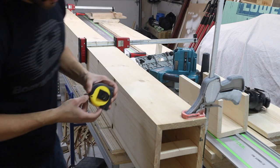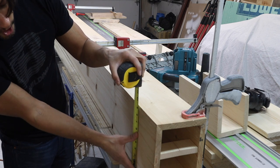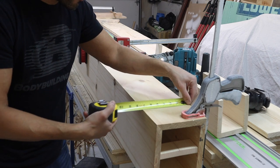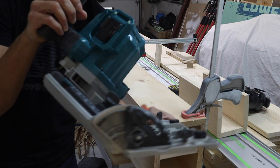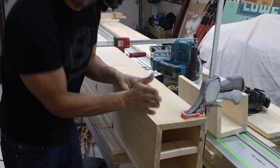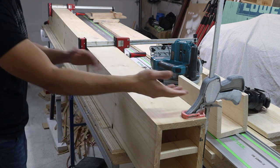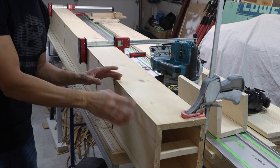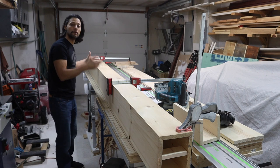I needed this to be seven inches across, and I went nine and a quarter across to wrap the lolly column. This board was already cut to seven inches, so I ran the saw on its 45-degree axis, put the track right up against the edge of the board, and made that long miter fold cut. You can see here — clamping it in place with no glue whatsoever — I'm going to walk you down this line and this thing is absolutely pristine. We're going back to this technique.